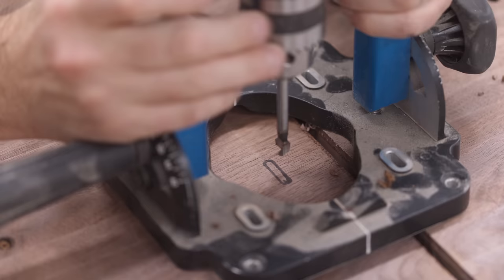I'm using some Total Boat four-minute quick-curing epoxy and brushing that onto the end where it contacts the epoxy on the tabletop. I had to get a little creative about this glue-up as I don't have any clamps wide enough to apply even clamping pressure to the whole cabinet. To fix this I cut some two-by-fours to be the same height as the tambour cabinet, then rested other two-by-fours across them, and clamping on each side gives me equal pressure to secure the tambour cabinet to the tabletop.